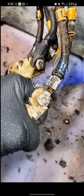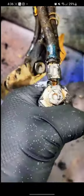We ordered new bearings and those came in. I did not like these electrical connections — I simply put the bolts back in and did not put these little bulldogs back on there. I zipped them to the eye hook on the top of the motor. If they want to reuse them, they can. However, I would not advise using those. They should just bolt them directly to the feed.